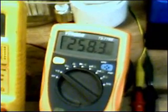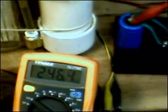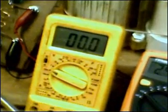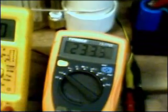Now at the top of the cell, this yellow terminal and this green one are the two terminals that come down and around to this voltmeter. This is an auto-ranging voltmeter, so any time I change from the battery terminals or from the cell terminals to the amp meter shunt, it automatically auto-ranges to the correct range. I also have a secondary meter which is measuring the millivolts across the amp meter shunt in real time, so I get both the current draw on the yellow meter and the voltage measured directly at the cell terminals on the orange digital multimeter.